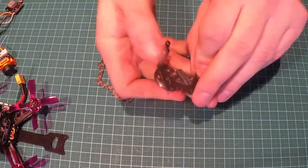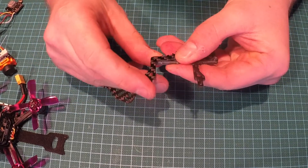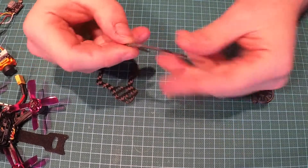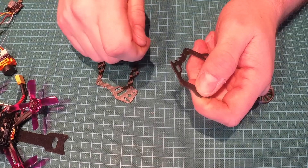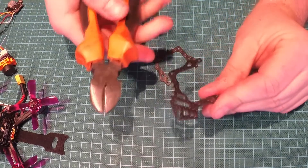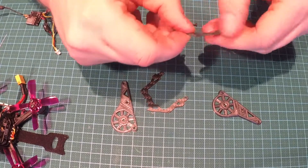From here you can fit this mount like this. I saw on Thingiverse there was a complaint about making this hole fit — it is pretty narrow, but you just need to squeeze it and it will fit. It's just a tight squeeze. What I did to make the cut was to use the Leatherman saw point. I just started getting this weak top spot off, and on the bottom I started to saw. After a while I got tired, so I just clipped it up with this clipper. Now we have cut both side plates.